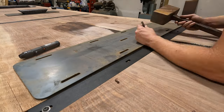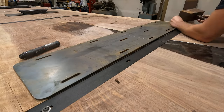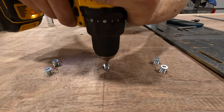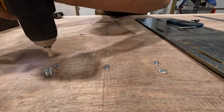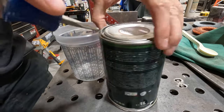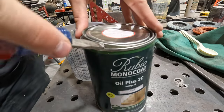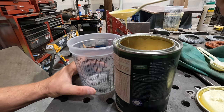In the past a lot of people have reached out asking if these tables are stable or shaky. The big key here is don't be afraid to put a lot of threaded inserts on your mounting surface for that mounting plate — the more the better in my opinion. There's just no way I would deliver a table if it was wobbly or shaky. These people are spending a decent amount of money, and their table needs to be solid.